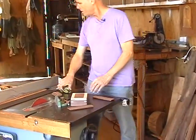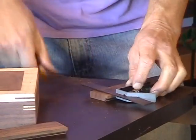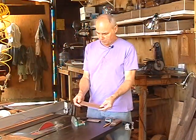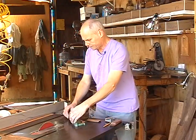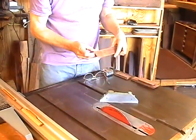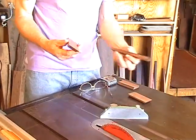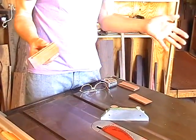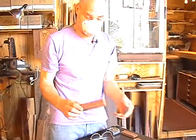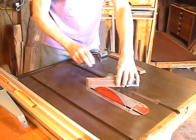I'm going to mark seven inches on this and scribe it with a square, just for visual reference — the table saw is going to cut everything square. Now we cut the critical miters to get exactly the length we want. I've run my first pass and it was a little short. One of the challenges is cutting a matching pair: the front and back of the box must be exactly the same size, as must the two sides. So I take very, very small passes when I get close until I reach my target.